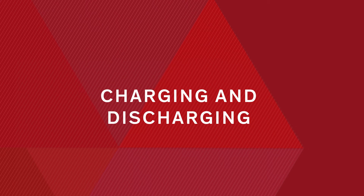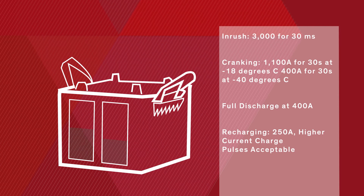Unlike lead-acid batteries, the X6T offers greater usable capacity and can support deep cycling. Any application that can successfully charge two lead-acid batteries in series can charge the X6T without modification. The X6T is best charged with a current-limited constant potential voltage source at 28.5 volts to 30 volts.